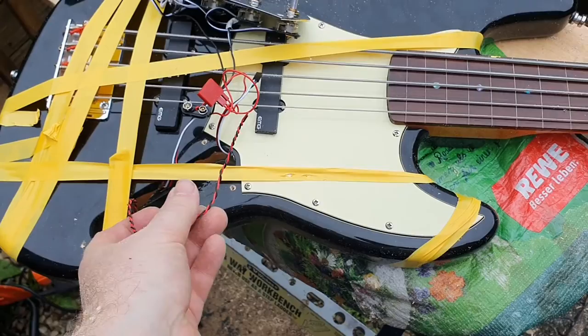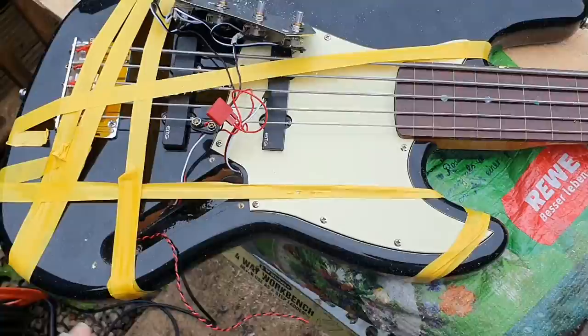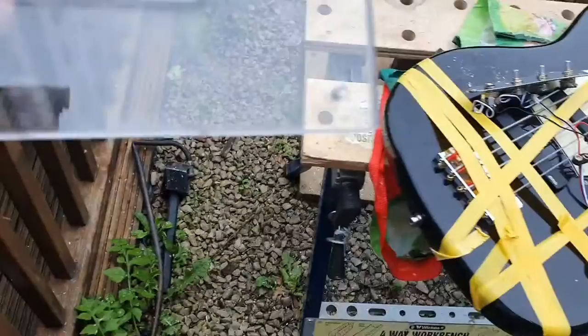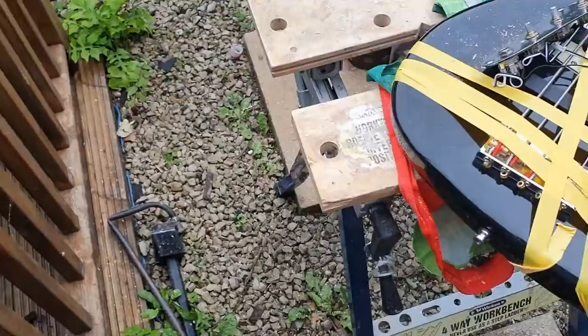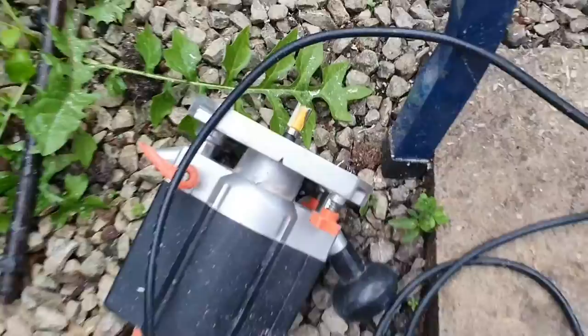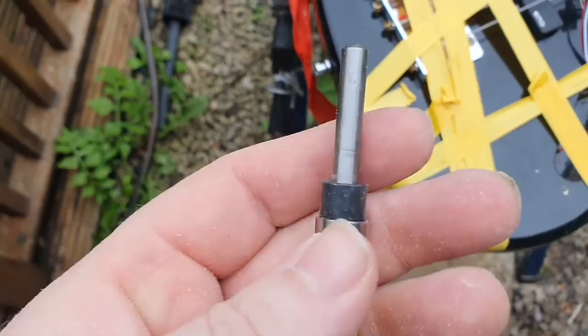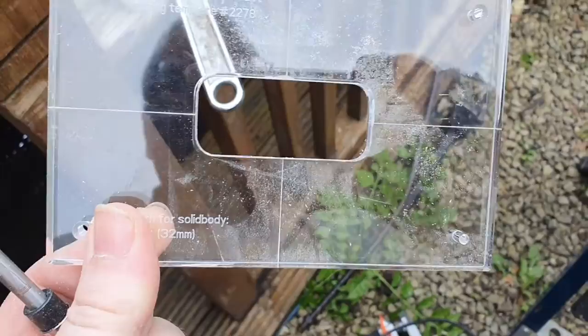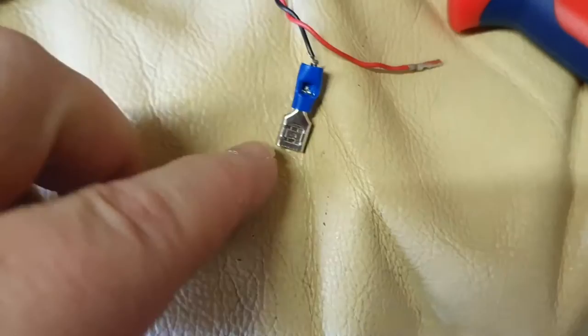That should go in nicely - job done. I used some of the ideas from Sniffer Customs because he's a super cool guy. I'll wire that in and then I'll have a beautiful EMG five-string fretless bass with a really nice clean sound. Let me show you what damage I did to the template - not bad, just a little nick here and there. This was done with the ball race bearing cutter. The small cutter did it all. I gradually went down by depth each time, following the hole I'd already made with the bearing. It's a bit rainy here in Berkshire but that didn't cause any melting. I did it slowly and took my time.